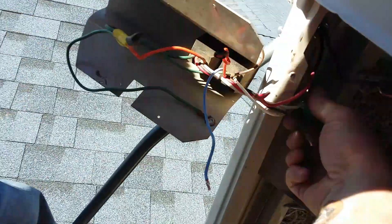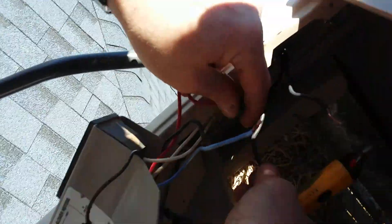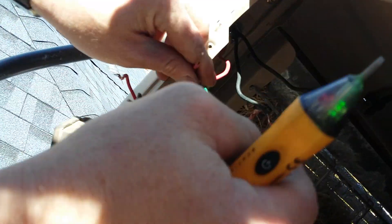Okay, greens good. The beep means it's live. White — we're gonna keep white together. The blue and the black were connected. Now I want you to test these two blacks. We can go turn on power down there. Take this one apart — we're gonna test the red.